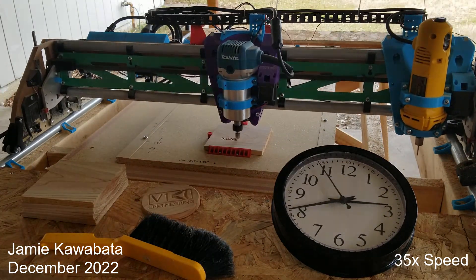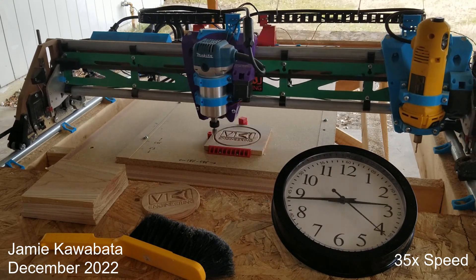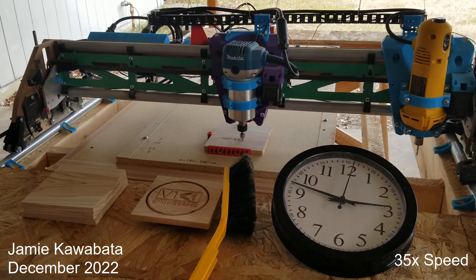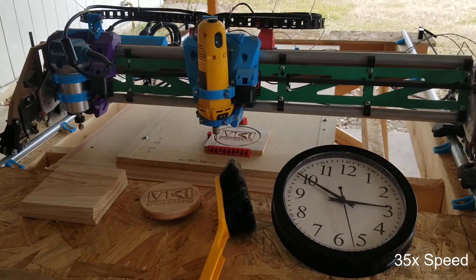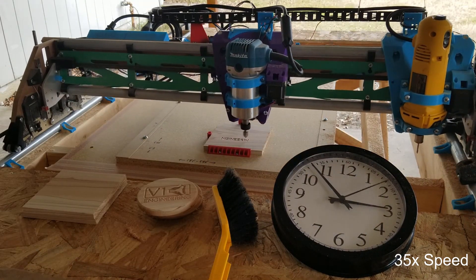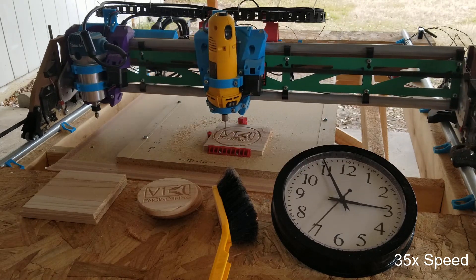There are a ton of use cases where I absolutely need two different cutting bits, but I pretty much never need more than two. The Lowrider 3 is a really solid machine to begin with, and in my opinion it's especially suited for this dual X carriage setup. One reason is that the gantry geometry inherently provides the shared Y and Z motion that the dual X carriage feature depends on. Another reason is that on this machine, Marlin is the default choice for firmware, so it's not such a huge leap to enable the dual X carriage feature.